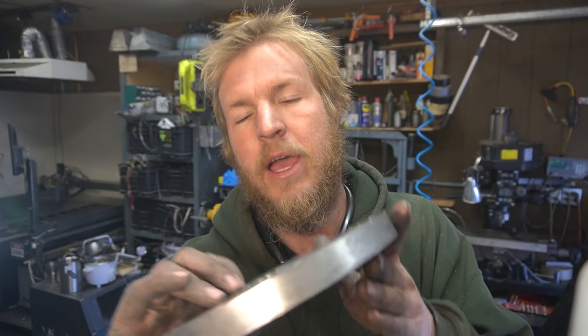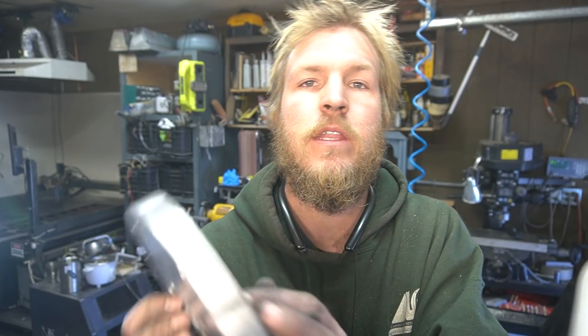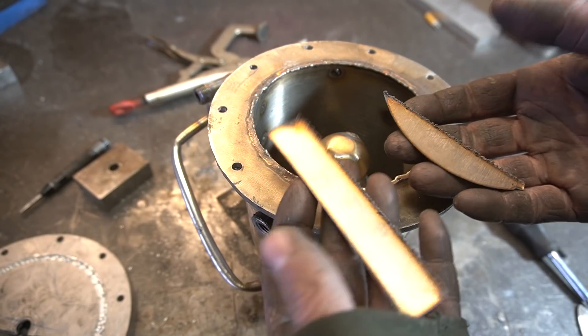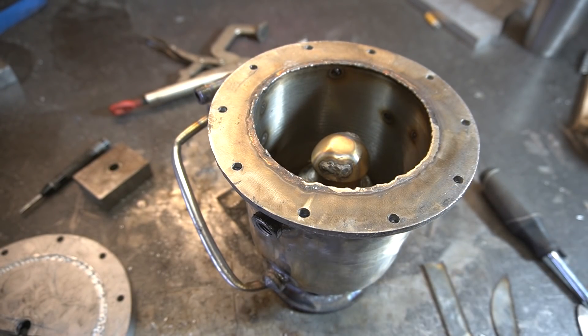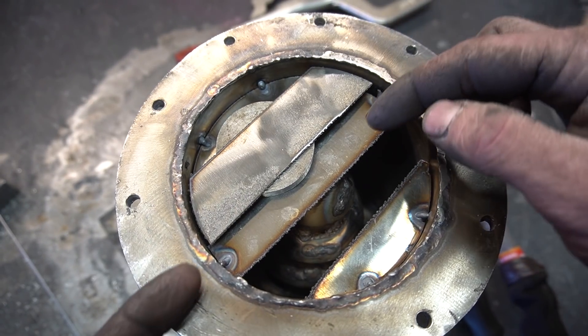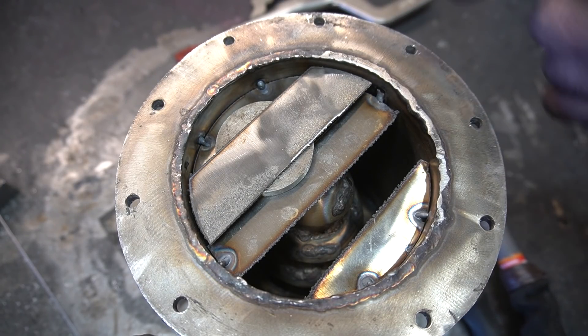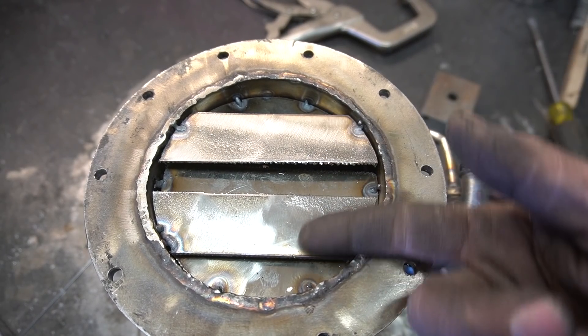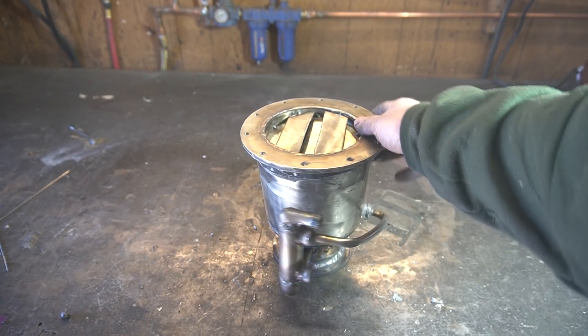As you can see, this thing is a hot mess. I don't like it, I don't want to waste any more time on it. I don't really use that mill all that often so everything is loosey-goosey — it's chattering all over the place and I don't have any tooling that can actually cut that right angle. So I think before I waste any more time building this thing, I'm gonna order the proper tools and just do it later. My temporary solution that will become permanent if it works good enough is these little pieces — first layer goes in like that, then the second layer goes on like that. It's the same concept where we're gonna have to make a right angle turn to get through. That's basically this thing built. Now we just need to test it.